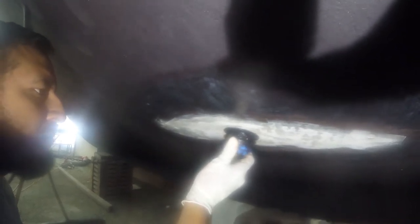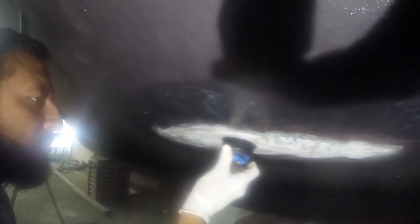Alright, at this point, stop. Okay, now start rotating it. We've got everything fully caulked and cleaned and flattened. We have caulking, slow down, go real slow. We have caulking in between the gasket and the through hole head. And we have caulking, which is 5200 black, up on the top surface. The top surface is ground and cleaned and then acetoned. And then we use more 5200 on the top in between a gasket on the top and then the flange nut.